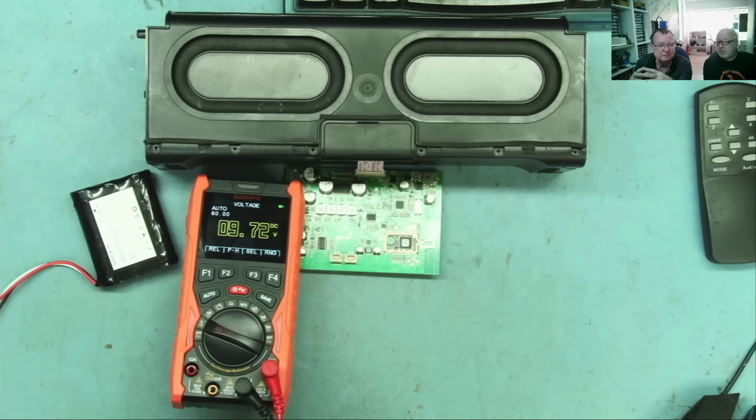This is pretty low, because this is 3.2 volts per cell. So I'd call this deeply discharged. So what's fully charged? For a LiPo cell, it would be 4.2 volts. And since this is an unknown battery, we don't know it. This came with the whole package you told me. Yeah. And I'd say we try to get some current in there to be sure that it takes charge.